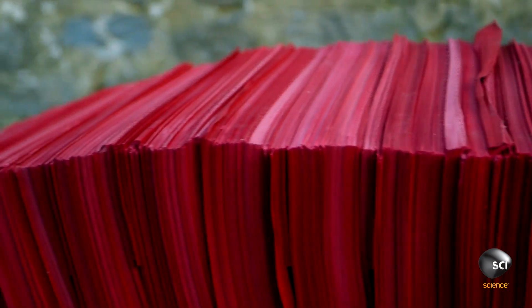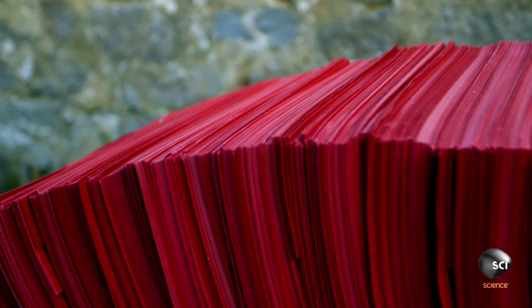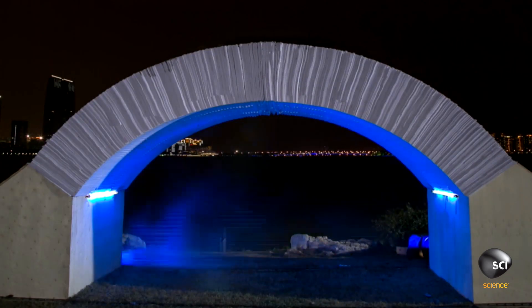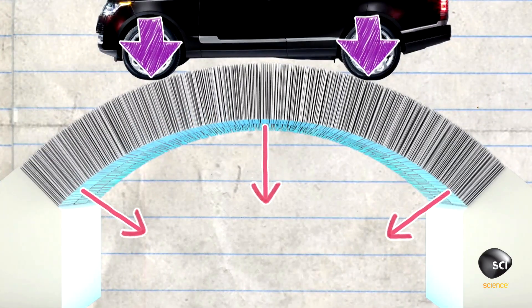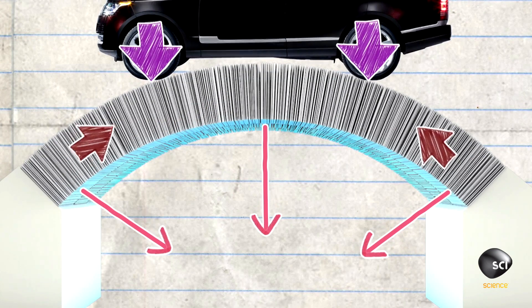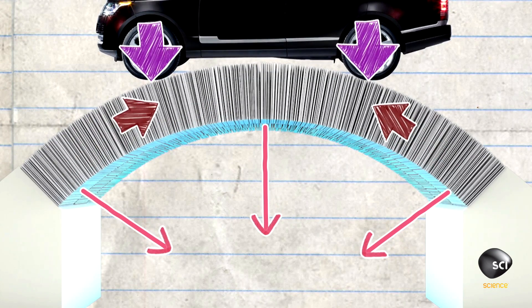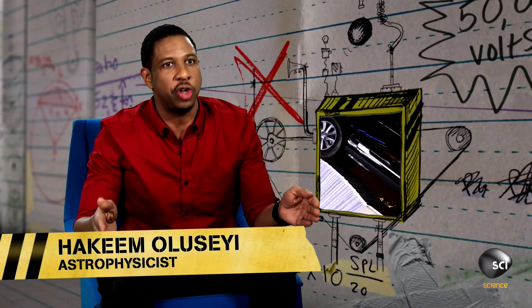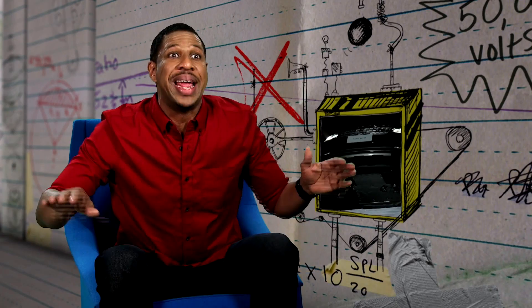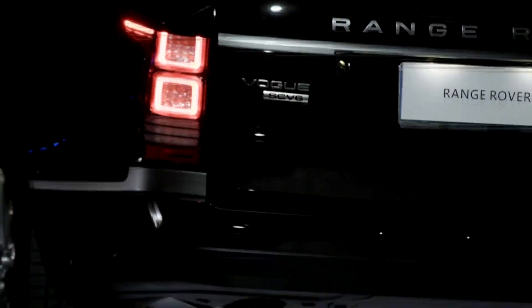But how can flimsy sheets of paper support the weight of a car? If you're going to build a bridge out of paper and you're not going to use any other materials like cables or glue, an arch is definitely the way to go. In an arch like this, all the pieces are angled so that gravity pulls them into each other. So the pieces on the side are wanting to fall in towards the center, but the pieces in the center are pushing back, so everything just gets locked into place. At the ends of the bridge, there are two abutments and they stop the bridge from actually splaying outward. And the result is a very strong structure.